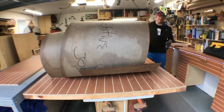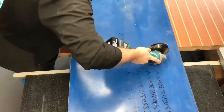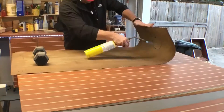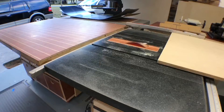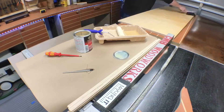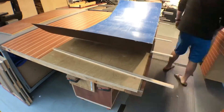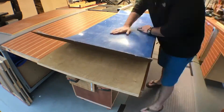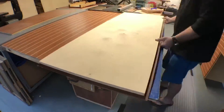All right, let's get right into it, guys. This is a piece of laminate I found at my local salvage yard. They sold this to me for around $2. It really isn't kitchen worthy anymore, but it's perfect for shop applications like this. The Baltic birch plywood I'm using is three quarters of an inch thick and another sheet at one quarter of an inch thick. I'm going to go ahead and apply some contact cement to both surfaces of the laminate and the wood. Once that gets tacky in about 15 minutes, I lay it on there and clamp it overnight, giving me a really strong, secure bond.